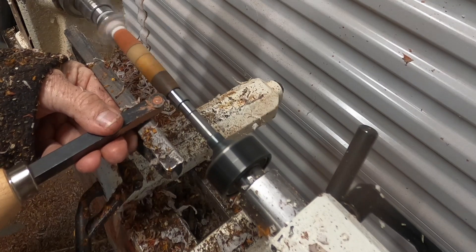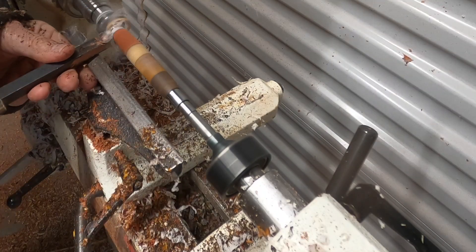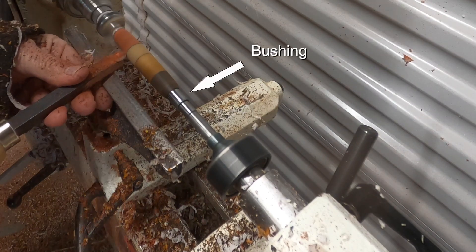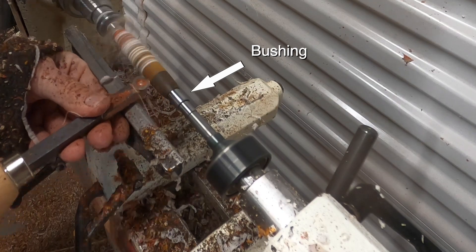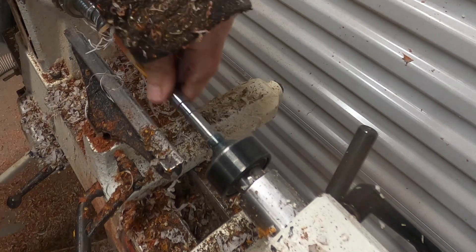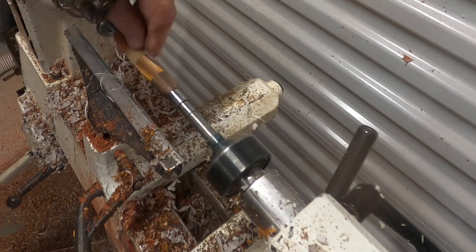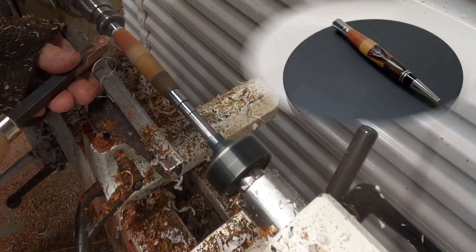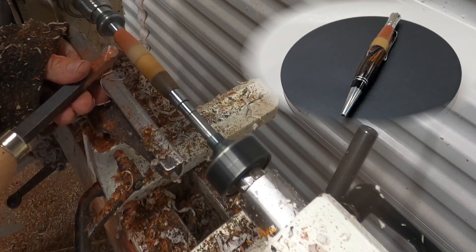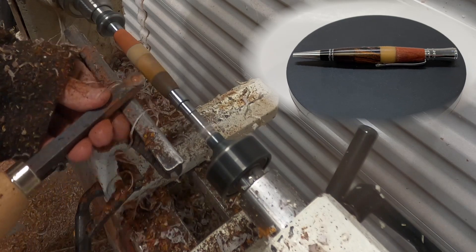Now that I've moved to the ends, which is critical — you need to get to the same dimension as the bushing. I don't want to go past that with the carbide bit, otherwise it won't fit the kit right — and that's a big mistake. So I switched to the round carbide bit because it hits a smaller area and I can do finer detail with it. It's not as aggressive, making it the perfect tool for this finishing stage.